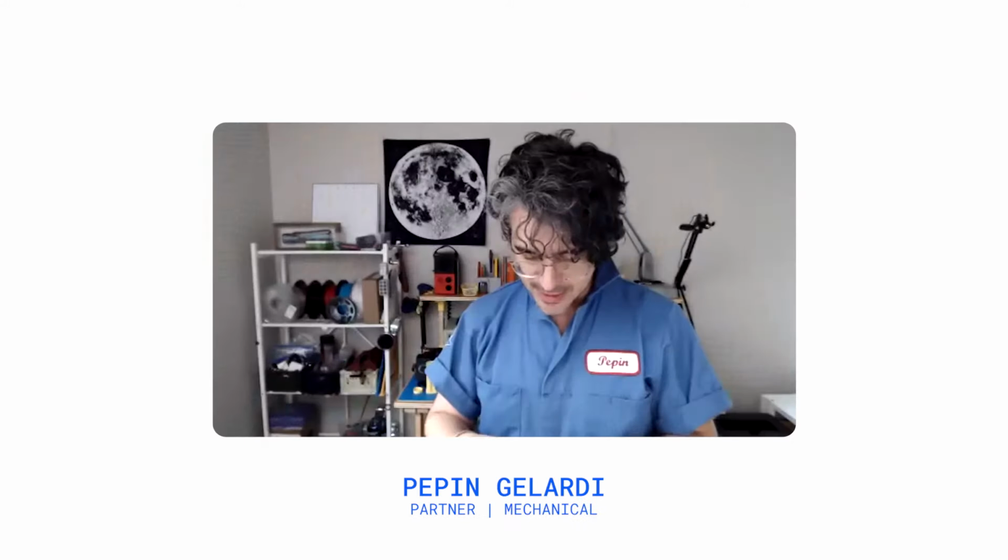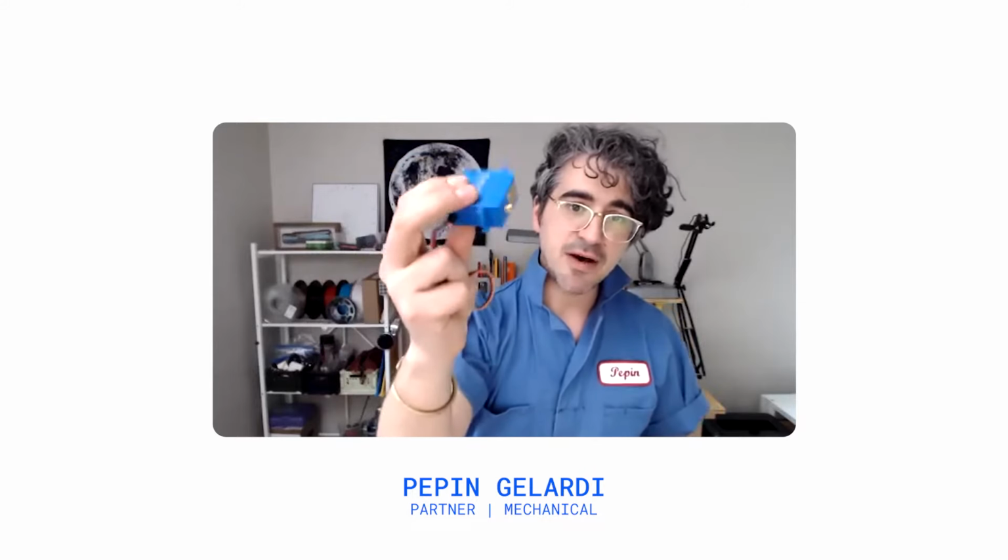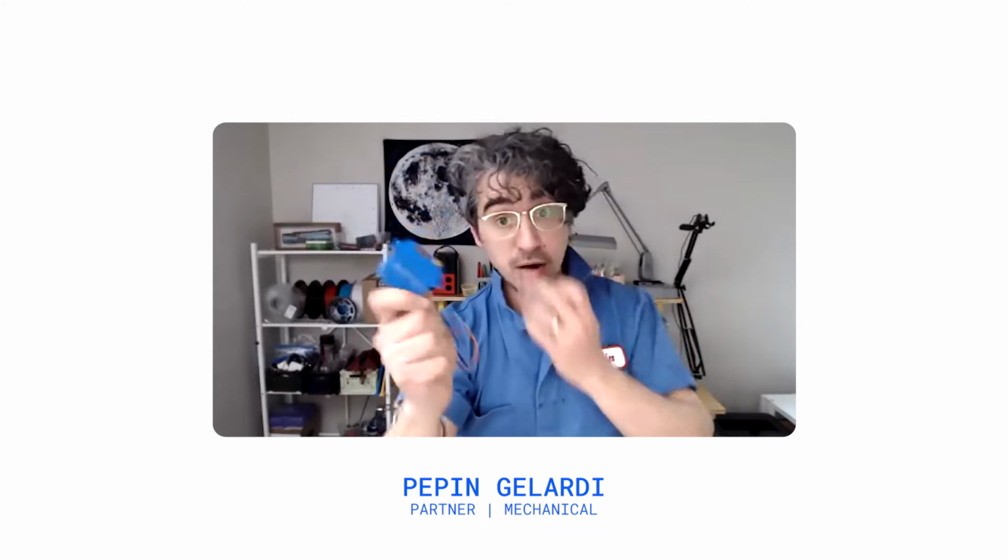And we found that this space right here, as we discussed, between the second and fourth wheel, is what we're going to use to fit our brake in. And we landed on this size servo here. We found some of these Savox servos in stock at Tomorrow Lab. They're waterproof and they're torquey. They have half the torque that we think we need, but that's okay because we're going to use leverage to get all the way there.